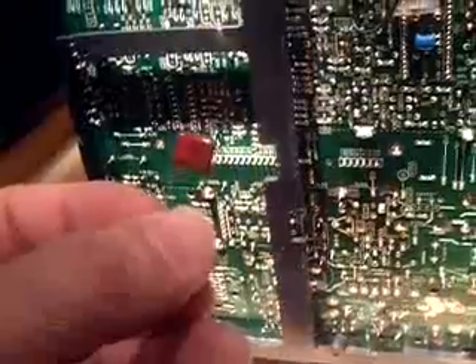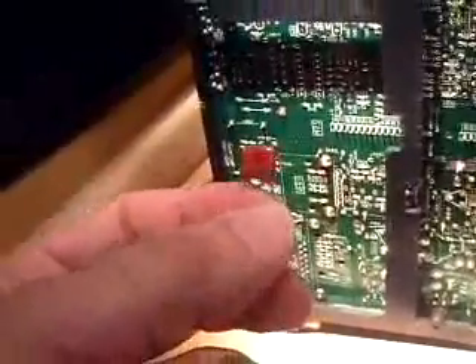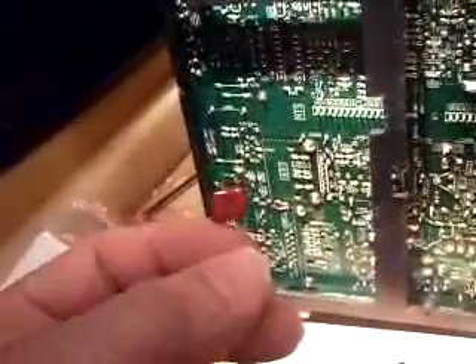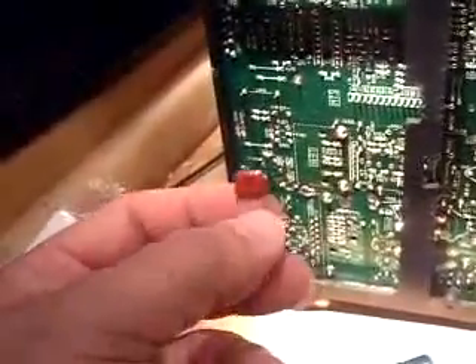That's really not the best design that Toshiba did there, but I guess they couldn't do everything correct. You have to have some planned obsolescence in there. I'm also replacing some of the polyfilm caps — this one's a 0.22 microfarad. I figure as long as I got the thing apart, I'm just going to replace all the capacitors associated with the vertical section. The set is just so heavy. To take it out of the living room and carry it back — might as well just hit all the caps in one shot that deal with the vertical, because I don't want to keep taking this thing apart.